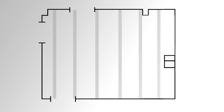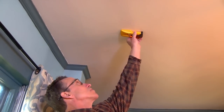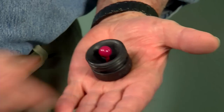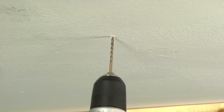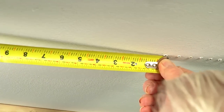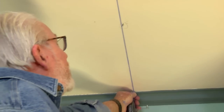The metal tiles will be attached to one-by-three furring strips that must be installed perpendicular to the ceiling joists, so our next job is to locate those joists. A stud finder set in deep scan mode does the trick. A magnet can also be used to locate joists by detecting screws or nails beneath the surface — this version makes a popping sound when it senses metal. As a last resort, a series of small holes can be drilled until the bit encounters solid wood. A tape measure placed on the first joist will often reveal the location of others at 16 or 24-inch intervals. The joist locations are marked on the ceiling near the walls, then connected by stretching and snapping a chalk line between them.